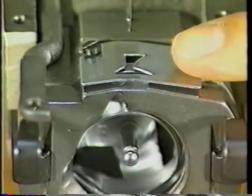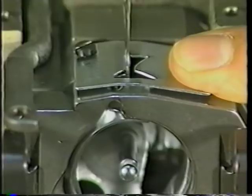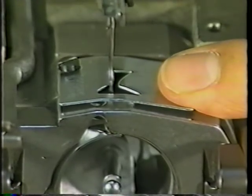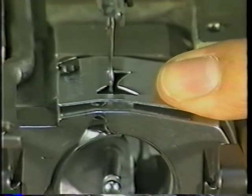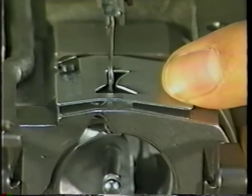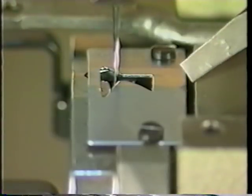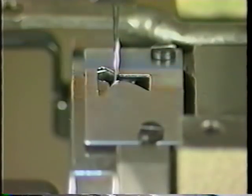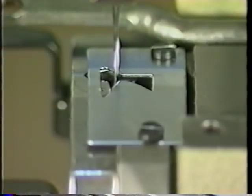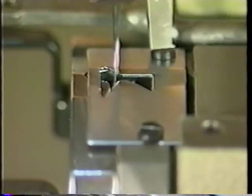Lower the needle. Move the spring to the right and to the left so that the needle has equal clearance on the right hand and left hand sides of the slot in the spring. Adjust the slot in the spring with respect to the longitudinal direction so that corner A meets the rear end of the needle. Now, tighten screws B in the shuttle race spring.